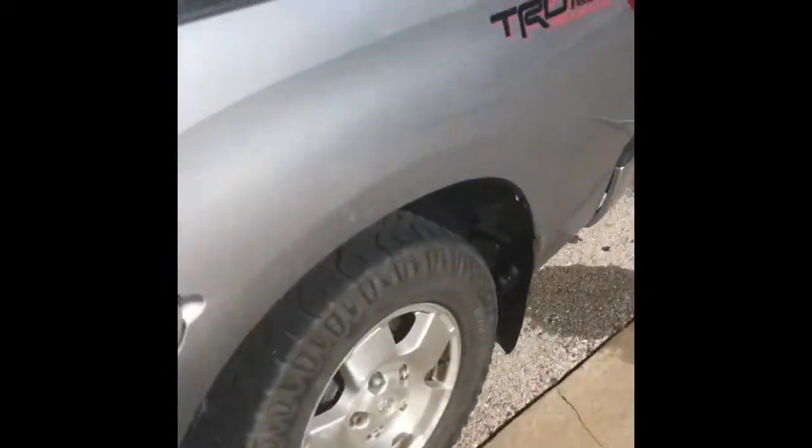With concrete, you want to rely on both chemicals and your pressure washer. The pressure washer I'm using today is 4,200 psi, 4 gallons per minute, which is working off my buffer tank, and then I'll be using my 28-inch big guy surface cleaner. All right guys, I'm gonna finish applying these chemicals. See, it's been maybe 2 minutes and I've already covered that much ground.